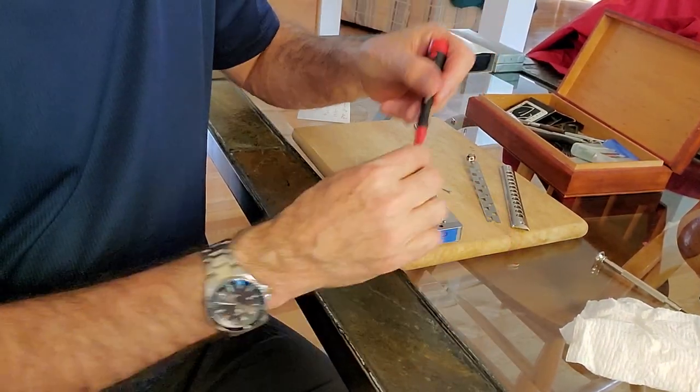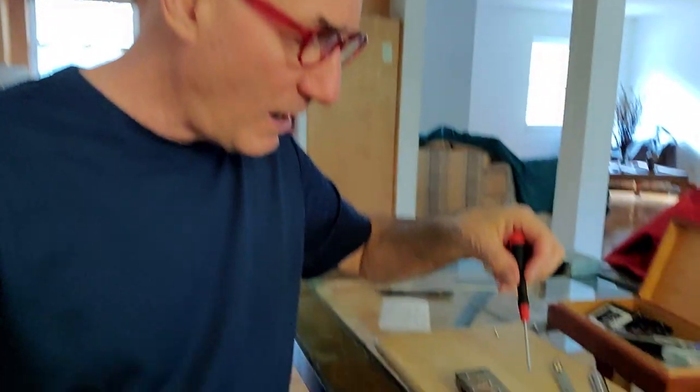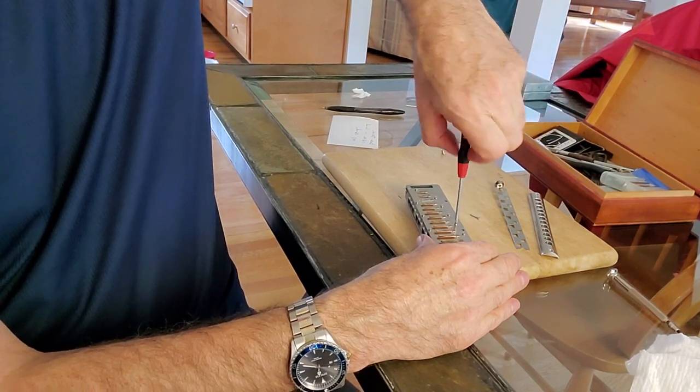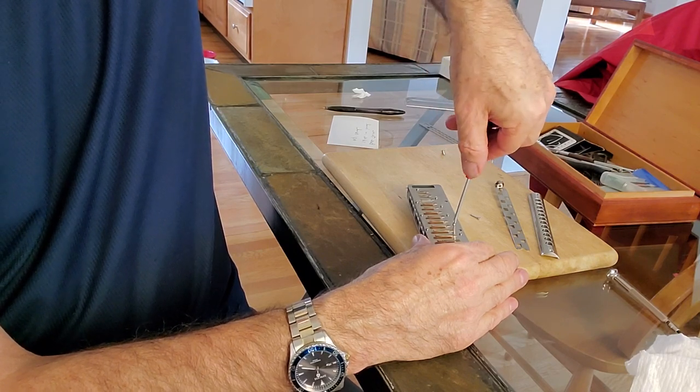Here's another piece of advice. You have two options when tightening a screw: you can grip the screwdriver with your hand and try to adjust tightness with your arm muscles, or you can hold the screwdriver and let it slip a little in your fingers to control tightness. Letting it slip in your fingers is actually the better way because you have more control with your fingertips on pressure than you do with your whole hand. When I'm coming down and tightening, I just let it slip — see how it's slipping around my fingers a little right here? That slip determines how tight it's going to be.